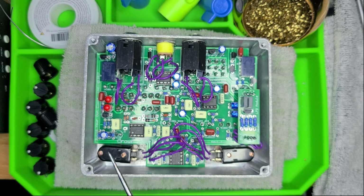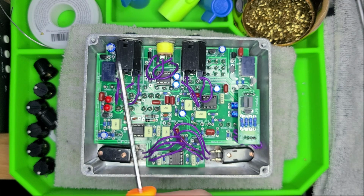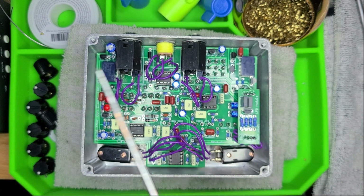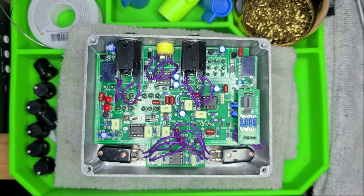I go and put in the mentioned black parts, input, output, and foot switches, and put the back plate on and everything else, and I was super excited, plugged it in, and there was nothing. Now I did plug in the input and output jacks and tested it, and there was a through signal, so the clean guitar or anything going into this or anything coming out of this was still running. There were no problems there, which led me to believe that something was grounding out and not activating the actual circuit, the board, all of this.